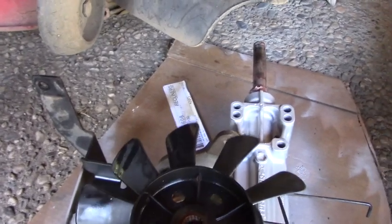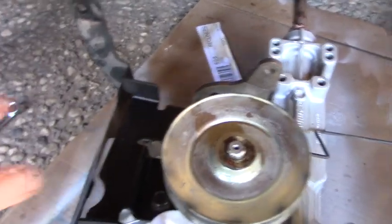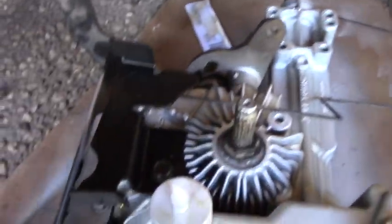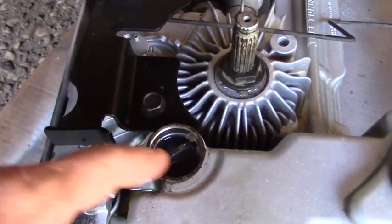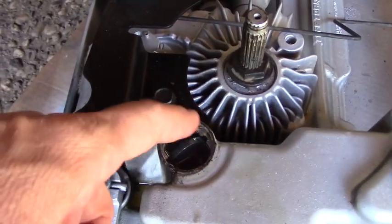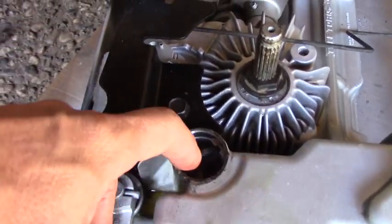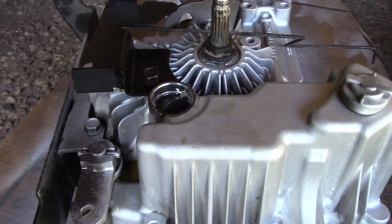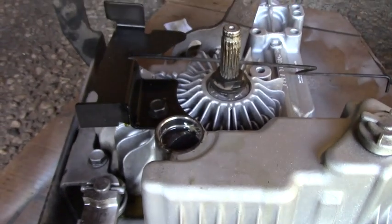And then once it's off, there's a little snap ring, so you do need snap ring pliers. You lift that ring out, take your fan off, take your pulley off, and then here there's a little rubber plug which is probably going to be destroyed because when they get old they fall apart. You can get a new one of these for about seven bucks — I'm waiting for mine. If there's a magnet here, you take the magnet out, you clean it, and then you just turn the thing over and let it drain. Holds about 2.3 liters of hydrostatic oil.